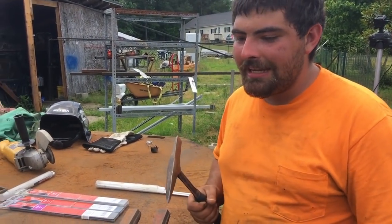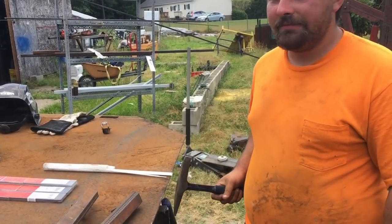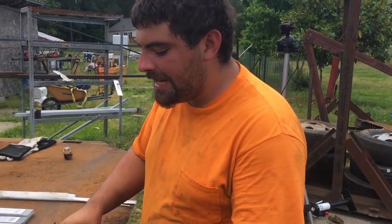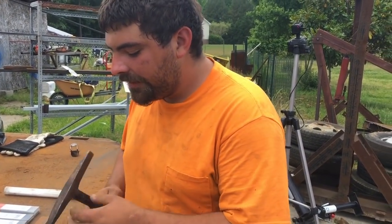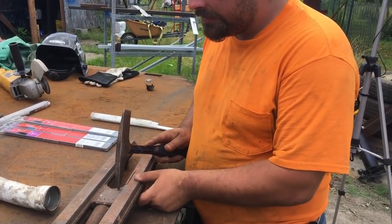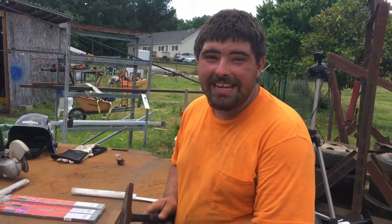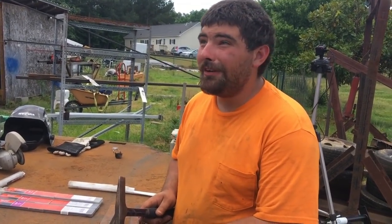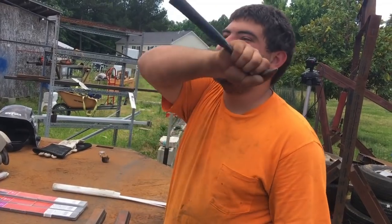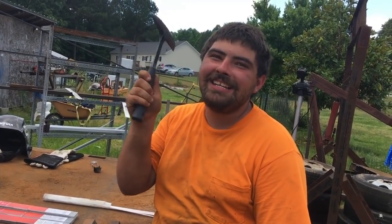And what I mean by peening, this is not peening. You're not beating the crap out of it. You're just going to go along the weld and be like, just like that. Basically, you're chicken pecking. You ever had a bad 7018? Everybody does it. You weld an overhead 7018 and you're like, come on. And the next thing you know, you're under there going ding ding ding ding ding ding, trying to gently get it off. That's about what you're doing.